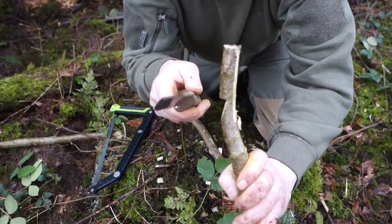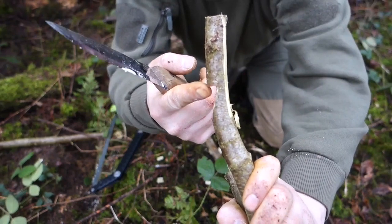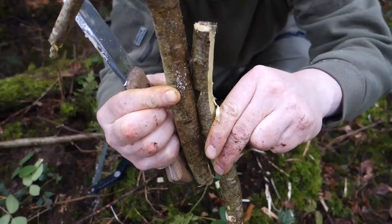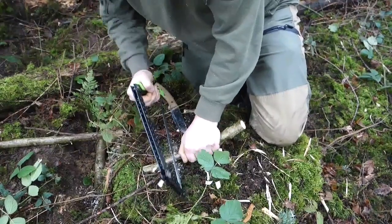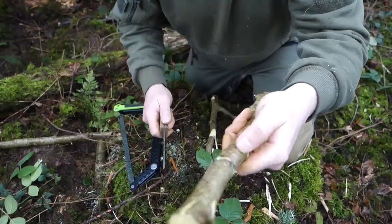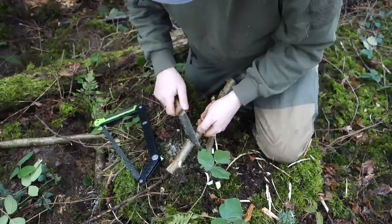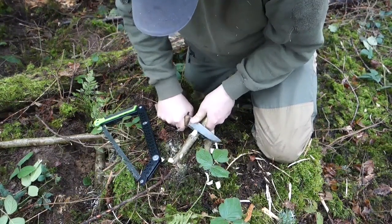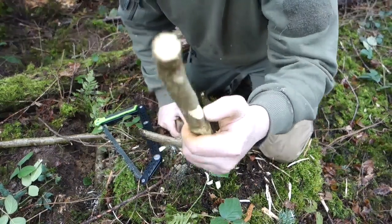And also, I just use a knife to go on the notch, to go back in on itself. You form that sort of angle then. So try and find somewhere where they meet, that they're close together. So this time, when I'm cutting through halfway, I've just cut back on an angle. Again, an inch from there, and then just take bits off at an angle to the bottom of your cut. So you end up something like that.